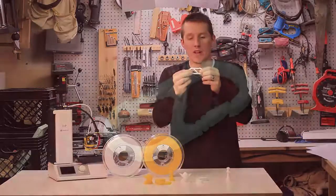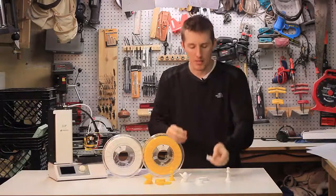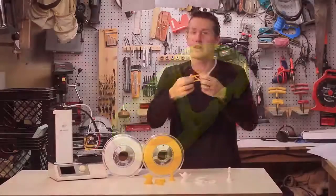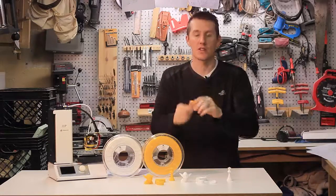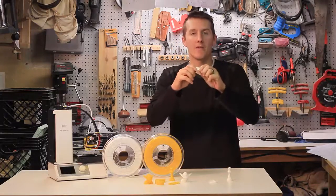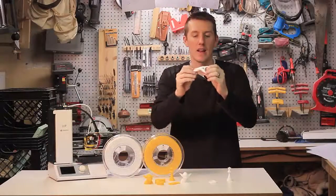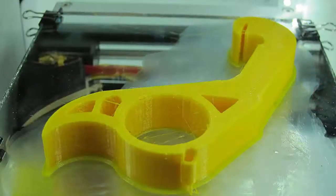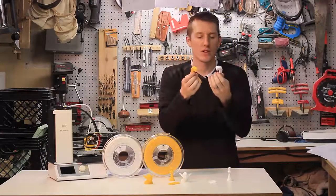As for the carabiners, they're not rigid like a PLA — they're a little more bendy, more like a PETG in terms of ductility. You can tell they're strong; not like PLA where I'm afraid it's going to snap any second. This stuff feels durable and handles well. As for the bottle opener, it's completely rigid but I'm not as afraid of it snapping like a PLA. These layers are super smooth together — you can hardly see them on either the yellow or the white. Right off the print bed, these are finished parts.